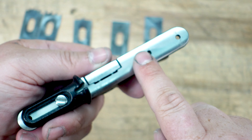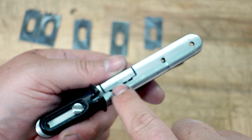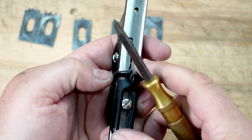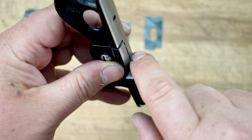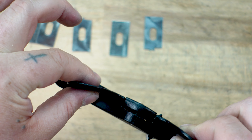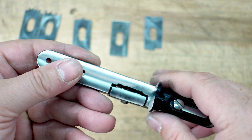This right here is a fence that goes into different positions, so you can put it closer or farther away from the cutter. The cutter goes in right here. All you do is loosen this screw, slide the fence where you want it, and then lock it down. The cool thing about this fence is it's also curved, so you don't have to just do straight boards — you can also do curves or circles with this.